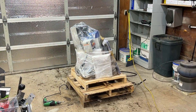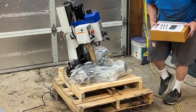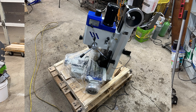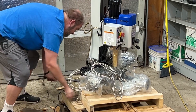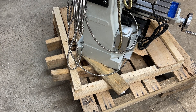Unpacking it was pretty simple. There were lots of boxes sitting on the cross slide table — parts and pieces, stuff for the DRO and all those kind of things. I carefully unpacked everything, inspected everything, and set it off to the side until I ended up with the actual machine there by itself. I used a lever to lift up on the machine and put some 2x4s and some three-quarter inch material underneath the machine in the back corner where it had fallen apart, doing multiple boards to get everything leveled up. I wanted everything balanced and sitting properly before picking it up with the cherry picker, and to make sure everything was relatively level before cranking through and checking that it was all working properly after the shipping damage.